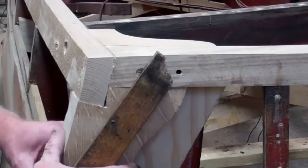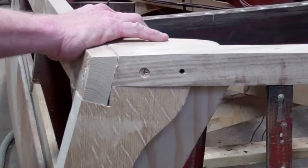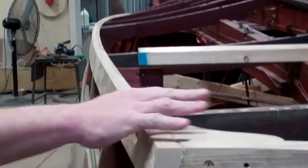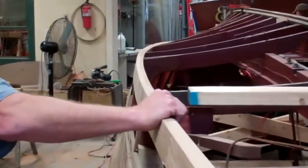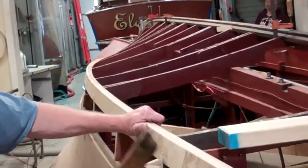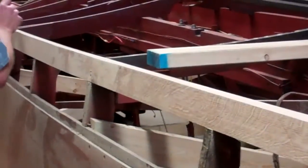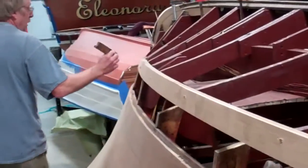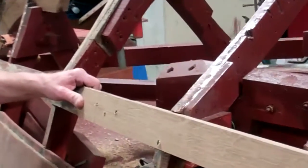Hopefully with the 5200 in between the boards, things will stay good and solid. This joint — I took out one that had a three-piece joint frame before, with a splice right here and one down there. Took that out, remade a new piece for the side of the joint, and scarf-jointed it down here. No butt joint — no butt joint.